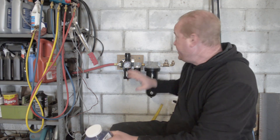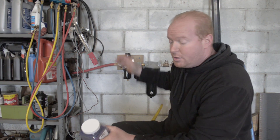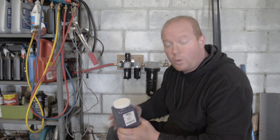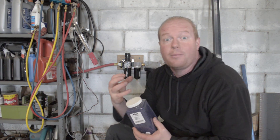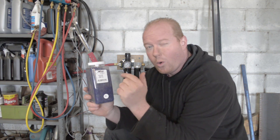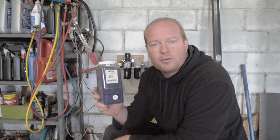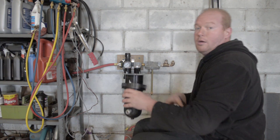I need to add desiccant to the dryer. It comes in one-quart jugs and my filter holds two quarts. These desiccant balls absorb moisture — the first stage gets big water drops and the desiccant catches the fine moisture, so the air coming out is super dry. You can use up the desiccant and replace it, or — a tip from the guys at Milton — if you put them in an oven at 275 degrees for three hours, it dries the desiccant balls out and you can reuse them. Please check with your wife first.